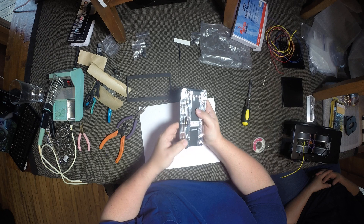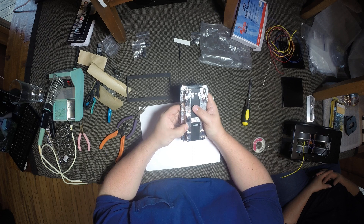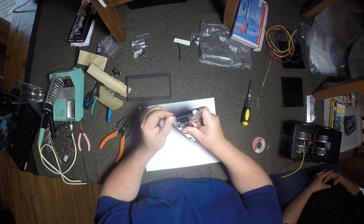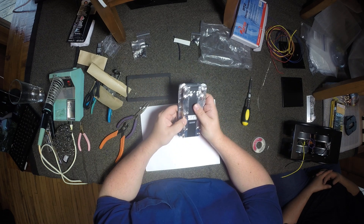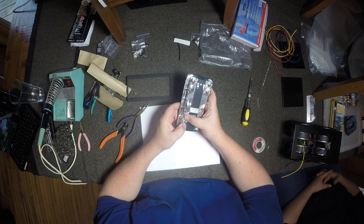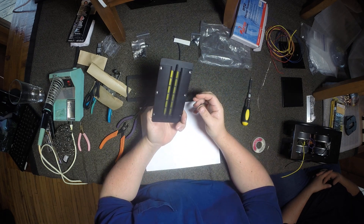Now Bob had suggested taking some black silicone and smearing it all the way around on the outside edges. You can do that if you want to, but I wouldn't necessarily recommend it because if anything goes wrong with the ribbons and it really is a warranty issue, I don't know that they're going to want to take one back that's completely covered with silicone. This way, if something goes wrong, you can just peel this tape off — it just peels right away. If you want to put silicone all around it you can, but you're still going to have to silicone every screw head because they leak just like the multiple layers will. So once you've got that, we're going to need another piece of tape there, another piece of tape there, and this one will be ready to install.